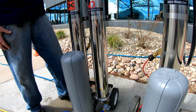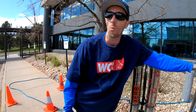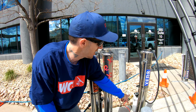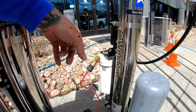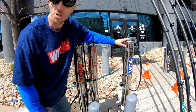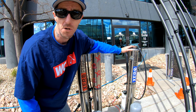Now, a lot of people want to know how long the filters last. That's gonna be dependent on the water quality of where you live. Let's go by the average rule of thumb of 100 TDS. We recommend changing your carbon sediment filter monthly. Every month you want to change that. That's going to really prolong the life of your RO membrane. Hypothetically, if you change your carbon filter every month, your RO membrane should last you several years, 2-3 years